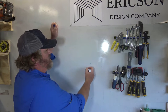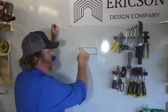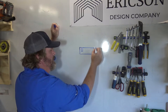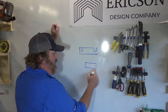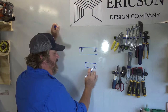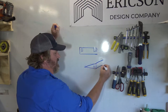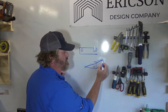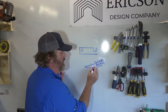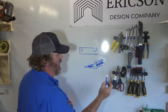My plan is to measure the MacBook and then lay out a piece maybe two and a half to three inches up for the back piece. I'll run a dado down like so and that's what the sides will fit into. Then I'll take the side piece, run that same dado in the back and then 45 it — the MacBook will sit up on there and rest. In the back we can either drill some holes with a Forstner bit or just hog it out and let the air pass through.